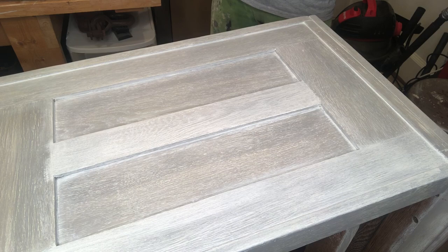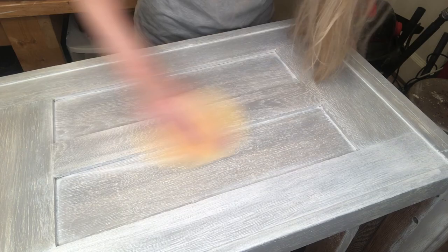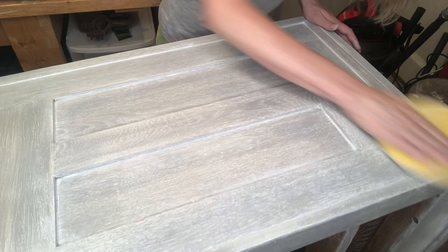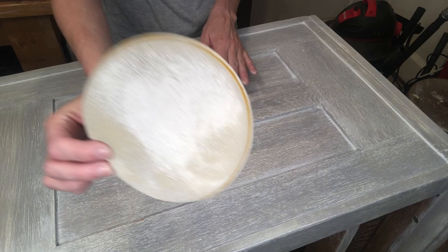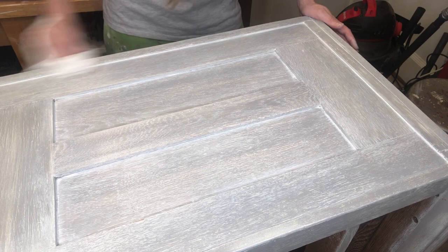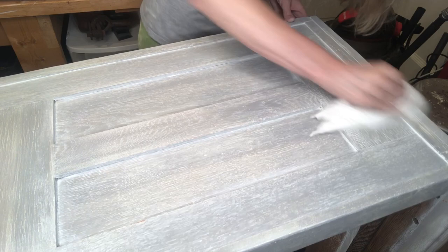Those last two sections are done — you can see this goes really quickly. This is basically foolproof. I'm already halfway done with this side of the dresser. It goes so fast, and that's another reason I love working with liming wax — it's easy to apply and fairly quick. You can see from my buffer pad how much excess is getting wiped off. Now I'm going with my clean rag to buff across and get that nice satin sheen coming out. It's really pretty, and this will provide the protection the dresser needs on the sides.